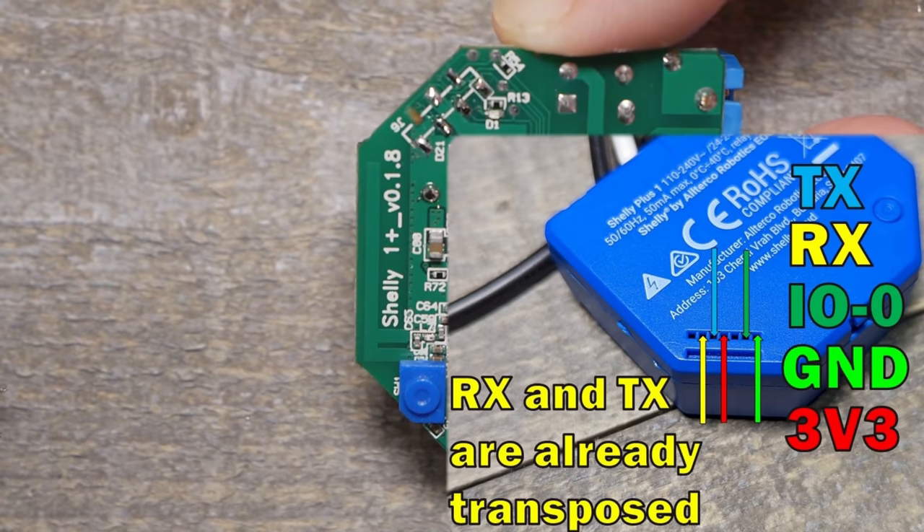There's a small red LED right by D1, and that's actually on GPIO 0. I did rip off one of the pads but was able to use another pad that had continuity back to the chip. Pretty cool overall for the Shelly 1. I'm glad they stayed with ESP — that way we can do all the things with it. ESPHome may not support this chipset as of the recording, but it's hopefully coming soon, and you can always just leave it on stock firmware.